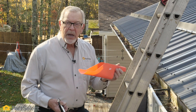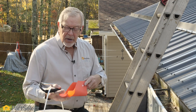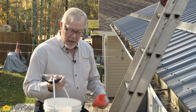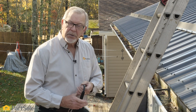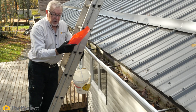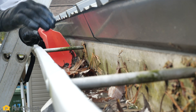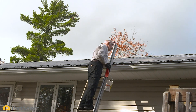You can either buy these commercially or you may even take a plastic jug such as a vinegar jug and cut that off — something that will fit down into your gutters and not damage them. Have a pail to put your debris in and a pair of safety gloves so we don't cut ourselves. We'll just take our scoop, get down in that gutter and continue to do that all along. You'll have to move your ladder of course.